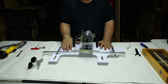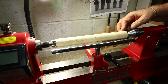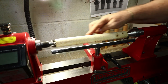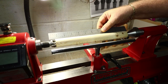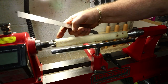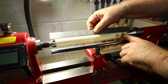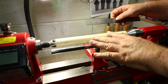Next I'll get this mounted up on the lathe and do a demonstration. Here at my lathe, I've mounted up a piece of two-by-two, one-and-a-half by one-and-a-half construction lumber — it's pine, so it's soft and won't turn real smooth right away. I got this turned and leveled, and I compare the straightness by putting a straight edge on it to see if there's any light gap. There's barely anything at the very ends, but the rest looks very straight. If you're going for a slope along the piece, you'd be looking for no light showing all the way for the entire length. The adjustment on this fluting table allows you to compensate for that angle.